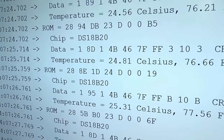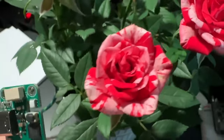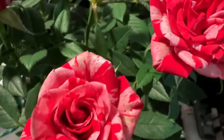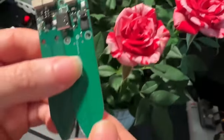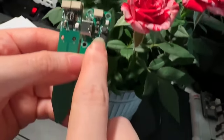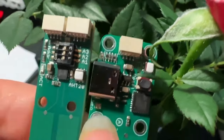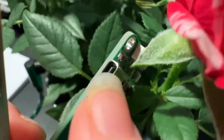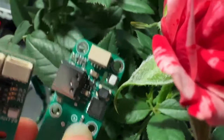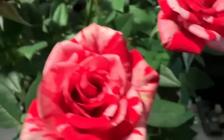A little handy solder-free way to quickly wire up lots of DS18B20s — coming soon to the Adafruit shop. I've also been working on improving our soil sensor board to add a STEMMA QT port, and at the same time I thought: why not make a Trinket-style board with a SAMD21, an SHT20 temperature and humidity sensor, a NeoPixel, a light sensor, USB-C for programming in Arduino or CircuitPython, a STEMMA QT port, and QT mounting bolts to attach an external STEMMA QT sensor.